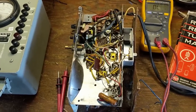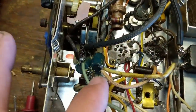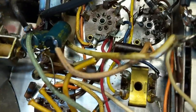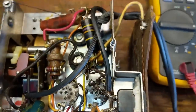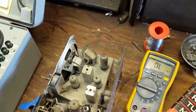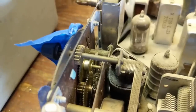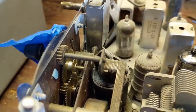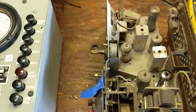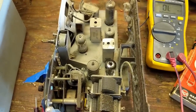Welcome back — day two working on the set. I had some stuff to take care of yesterday, but we see our two electrolytic capacitors are installed. Here are our two positives with the shared common negative, mounted close so they don't move around. I also replaced the cord. Last night I tested the set and I'm getting basically no filament at all — the 12AV6 should be lighting up, but I get nothing. That means either we have a fault in the circuit like a shorted resistor preventing filament voltage from reaching the tubes, or we have a bad tube.